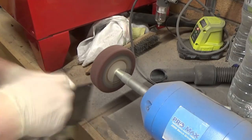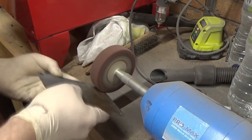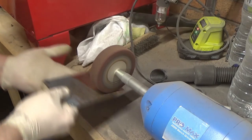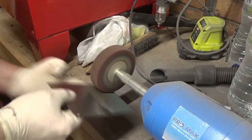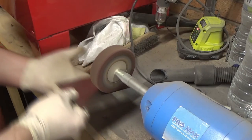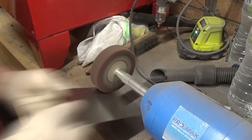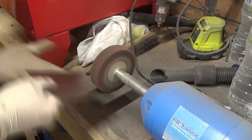This piece here is the part that sits on top of the headstock and covers where all the belts and back gear goes. The plate was pulled off just to have a look and check the condition of the belt. While it was off and I had the grinder going, I hit it with the satin wheel again because it was fairly heavily rusted. The paint is going to end up coming off anyway. A few people have said to paint it the standard colour — it's like a bluish grey which is a very difficult colour to find. So I'm thinking either a dark grey or a metallic silver.